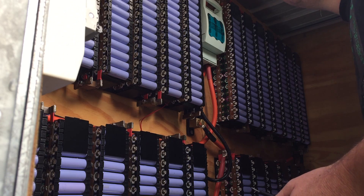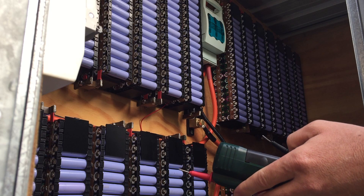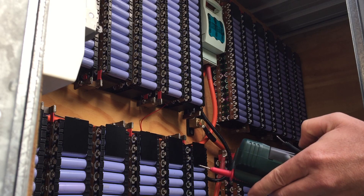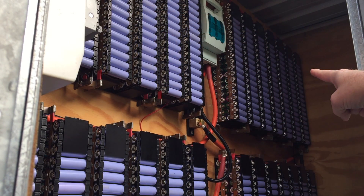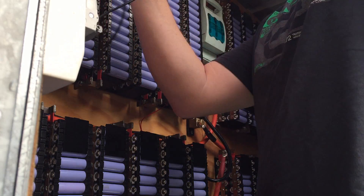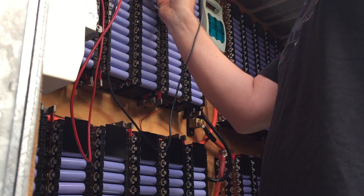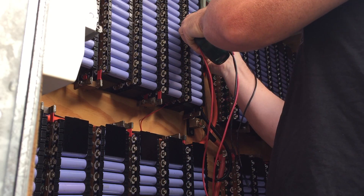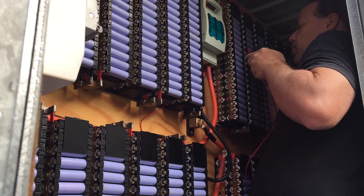The current voltage is 50 volts, but that's sort of come up because it's been off for about an hour now and it's been recharging off the solar panels. I'm going to go all the way along that 48 volt pack and then all the way along that 48 volt pack, and I'll read out the values as I go. So: 3.7, 3.74, 3.63, 3.66, 3.59, 3.69, 3.66, 3.58, 3.66, 3.66.